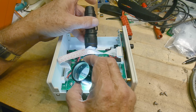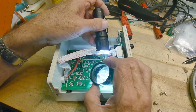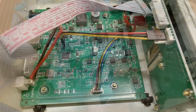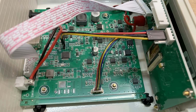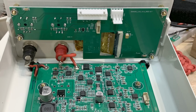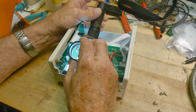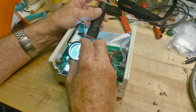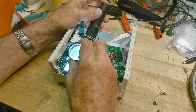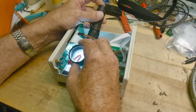Oh, switch, what is that? Is that an I2C memory? What is this over here? L3888. Don't know what that is over there. 538. I think that's an LM358, another op amp. Lots of op amps in this thing. Wow. All right, we've got some FET switches in here. We've got 2 big FETs. Those are both the same. And then we've got another LM358.